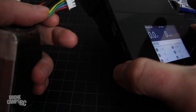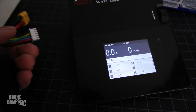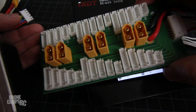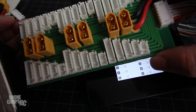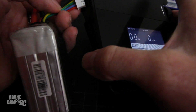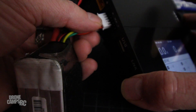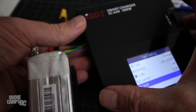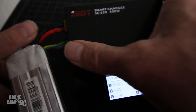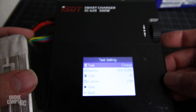I can go ahead and plug in my balance lead on the side. You can get the parallel balance board over at Hobby King — it's pretty awesome because you can charge up to 6 batteries at once in parallel, or charge a single battery. When hooking these up, make sure you do black on this side and red on this side. I'll press the button to go into the menu and show you the options: you can do charge, discharge, or storage. Going down to battery type, you can select high voltage, standard LiPo, Li-Ion, LFE, PB, and nickel metal batteries.